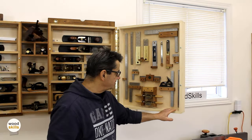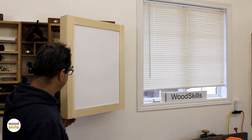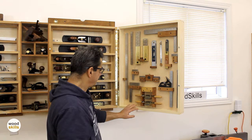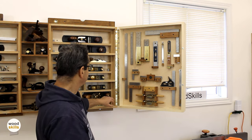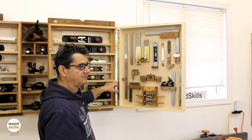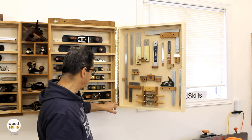Moving along to the right-hand door — it's identical to the left-hand door, with a dry erase panel. It's about three and a half inches deep, 24 inches wide by 30 inches high, mounted on a piano hinge for strength. Research indicates this is equally strong or stronger than conventional butt hinges, and I also strengthened it with longer screws.